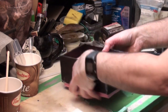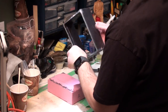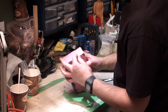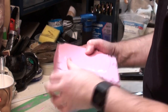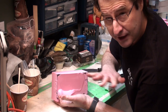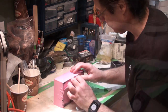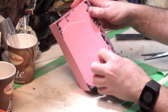Let's take it out of the mold box and hang on to the mold box for a moment because we might use this when we're casting. There's a little bit of seepage, but nothing too much — you can see it went over here a little bit. Let's lift this flap up. This is why we sprayed release agent over the entire block of silicone, especially with the body, just in case. You can see how nicely the silicone separates from the silicone because we sprayed it with release agent.